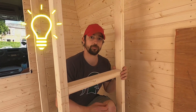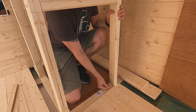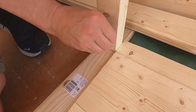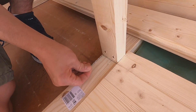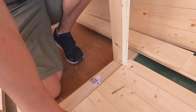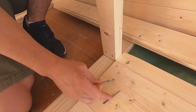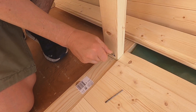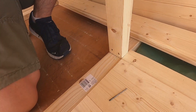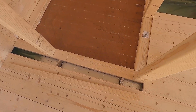We didn't have one of those jigs that drills diagonally, so what I did was start drilling with a small drill bit at 90 degrees, then tilt it and drill down, then repeat — 90 degrees, tilt, drill down — and then use a 6mm bit to drill down diagonally through the pilot hole. The screws fit in really well, so here you'll be able to see the tray.